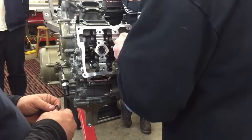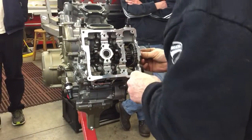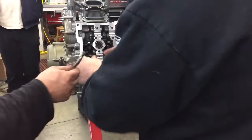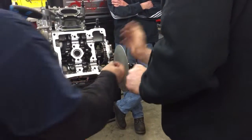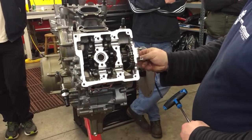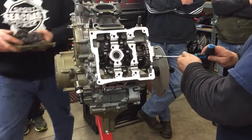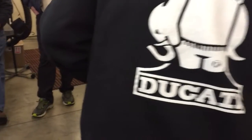You can see the threads in the parts. That's pretty cool — you can see the screws, you just feel something like that and think about the size. You expect to pick it up and have it be very heavy, but it's really thin wall with a small bore. There's a bleed hole, a drain, and once it's pressurized there's a damper at the end. Look at the features in the bottom — the grooves. They're holding something in there; they've staked that.